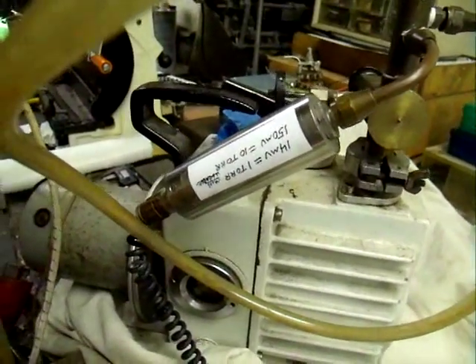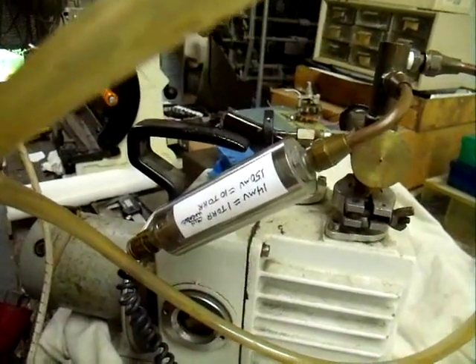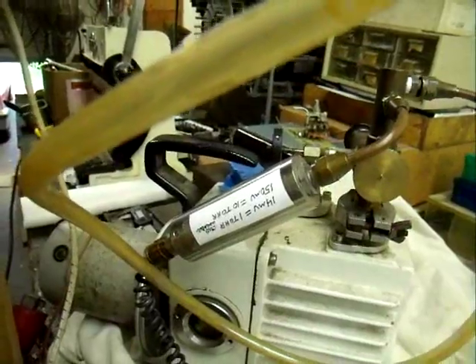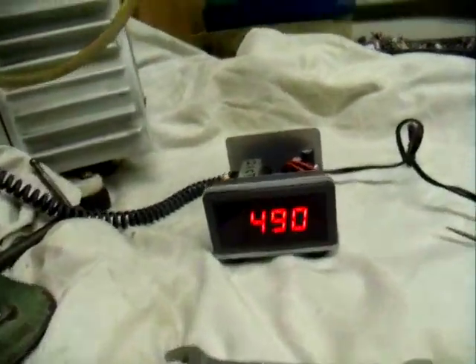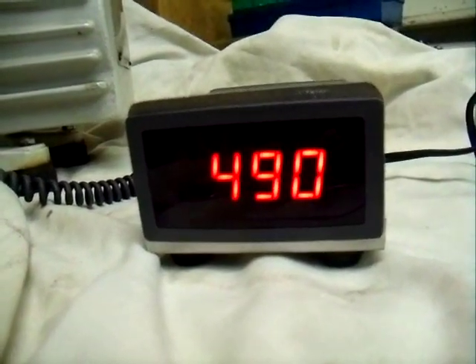You can tell by that range that we're not going to have an even number of millivolts, so we can't just take a digital meter and connect it straight to it and have it read out torr directly. We're going to have to adjust the scale to make it read linearly on our digital gauge. For a digital gauge, we've taken a little cheap Chinese panel meter — they work excellently. These are about 10 bucks, a three-and-a-half digit meter, accurate to one digit. The accuracy is set by the integrated circuit, so it can't be thrown off by poor workmanship.